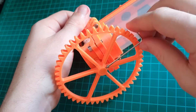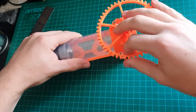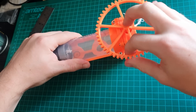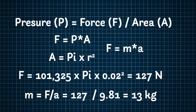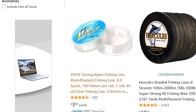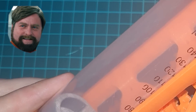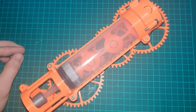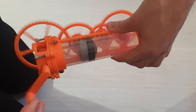Let's try it again. So it wasn't strong enough. I calculated the force required to pull the piston back based on a full vacuum in the syringe, and it came out at around 13 kilos. So I found some fishing line that said it could hold 17 kilos and bought it off Amazon. And that also snapped. In the shop I found some fishing line which said it could hold 54 kilos, so let's give that a go. With a slight redesign of the reel to accommodate the new fishing line, I gave it a test and it all seemed to work fine.